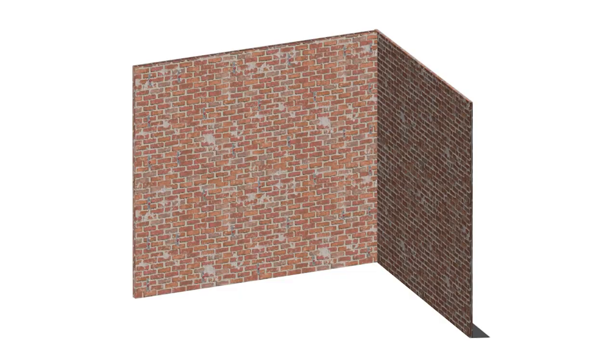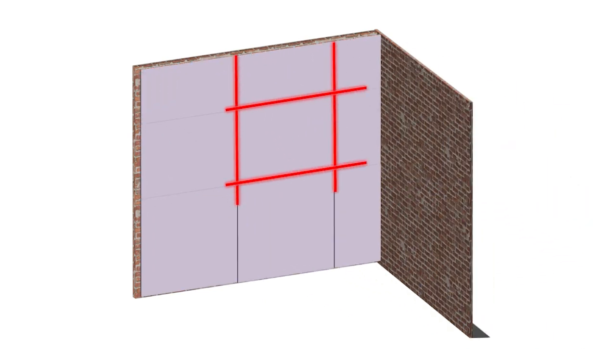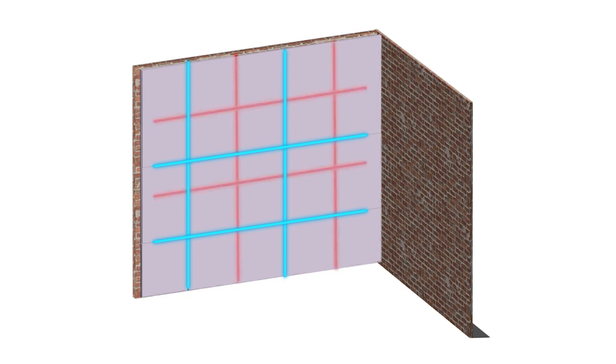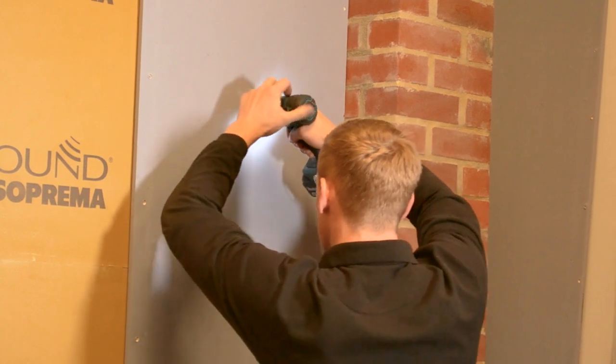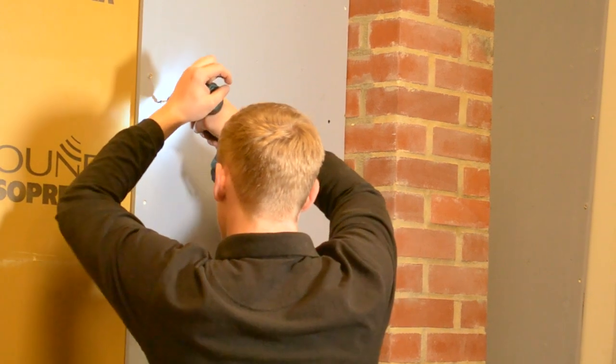After the membrane is on the wall, go ahead with the final soundproofing step: another layer of acoustic plasterboard. For this second layer we stagger the joins — if you began fitting panels from the bottom left last time, start from the top right this time, so we reduce the weak points in the system and overlap previous joins with a solid panel. This layer is fitted with 50mm fine drywall screws because the build-up is deeper. Use the channel guides you created earlier on the walls to line up the screws, and use a chalk line to help.